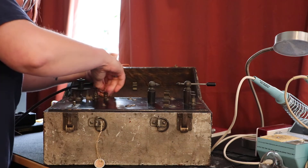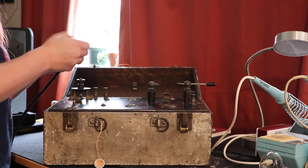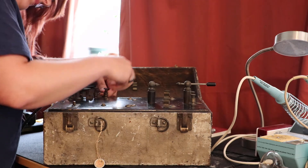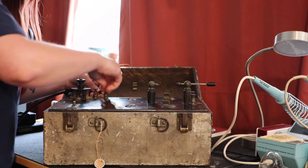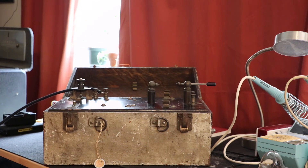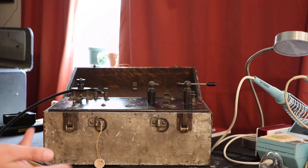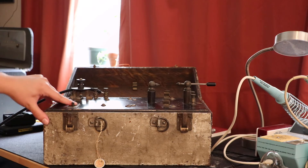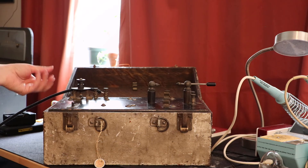So let's give it a whirl. The power cord is actually new — I've replaced it; it's just soldered, tinned ends. This is not polarized in any way. The dangers on these old machines are fairly apparent, but there's a possibility that one side of the Tesla coil primary is in fact in series with the hot wire, so caution is advised. When I turn it on and turn down the interrupter, as the points close you'll see a green spark there — you'll hear it.